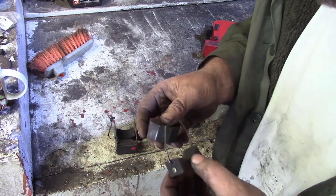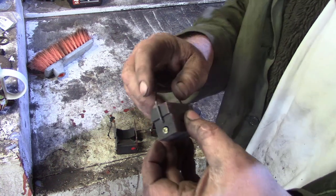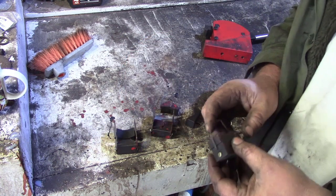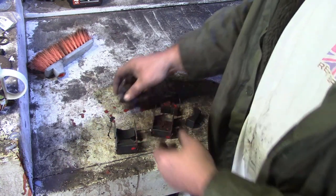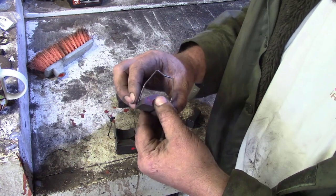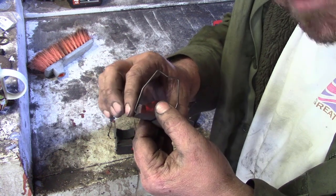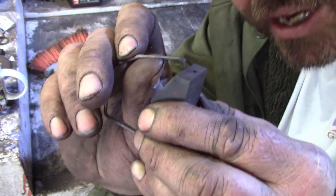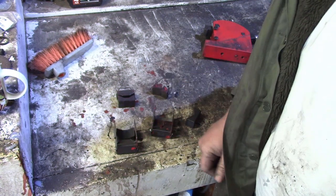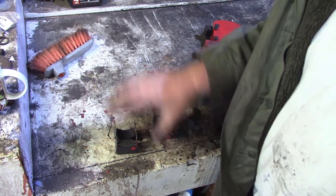Oh no, it wasn't quite all I did. We had to do a bit of fettling with this wire. But we'll get to that. Maybe we won't need it here. The long and short of it was, on the shrinkers, the wire was actually keeping these pressed in together, so I had to put a slightly more acute right angle on them and trim them down a tiny bit. But it's pretty self-explanatory.